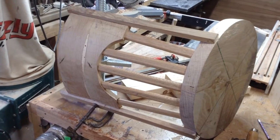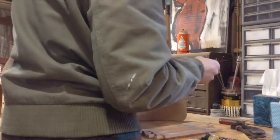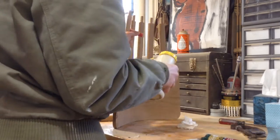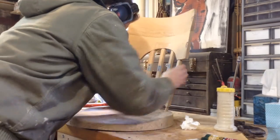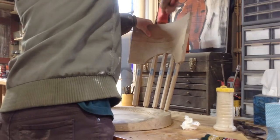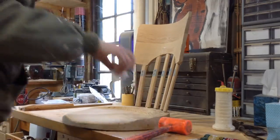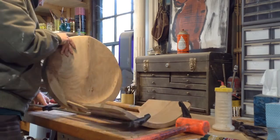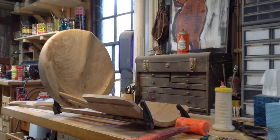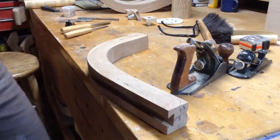That is the second one in place. Once I had those in place - it was easiest to do that without the top glued down - I went through and glued the center rails all together so those four center rails would be glued to the backrest and also glued to the seat. This was pretty easy because everything fit nicely - I put glue in all the holes and hammered it down; it's a nice fit. I added some clamps but didn't ratchet them on too hard because I didn't want to snap my rails - that's how I held everything in place while it dried.